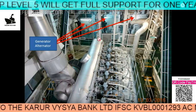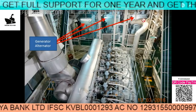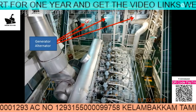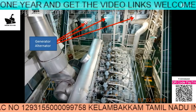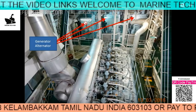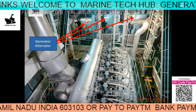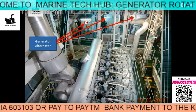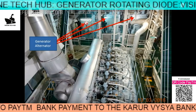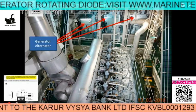In this picture you can see these are the three generators here: 1, 2, and 3. Normally when we start one generator we will have a voltage of 440 volts. In this case what happened was the voltage was 120 to 140 volts. So voltage was not building up. Another case it can happen is the voltage can be higher, maybe 500 to 600 volts. Both cases I will be telling you how to look into it so that you will understand better.